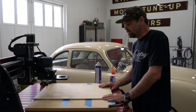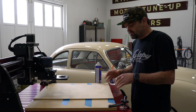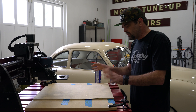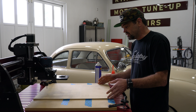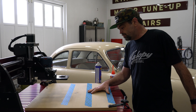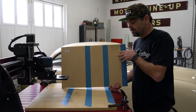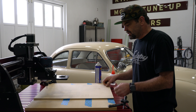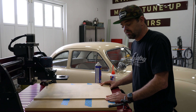If you've used a CNC at all, you know one of the biggest challenges is figuring out how to hold down your workpiece. Some guys build fancy vacuum tables, others build really crazy spoil boards with homemade clamps and all this stuff. I just don't have the time or the inclination, but a friend of mine came up with this idea: you lay down some blue painter's tape on your spoil board, put matching blue painter's tape on your workpiece, and all you do is super glue the tape together so that when you're done, you just take the tape off. I've never done this before, so I'm going to see if it works.